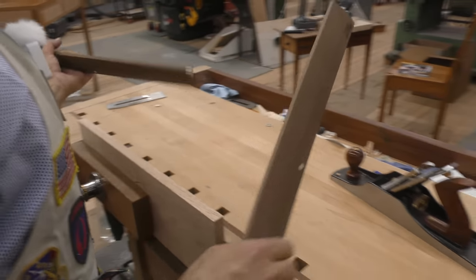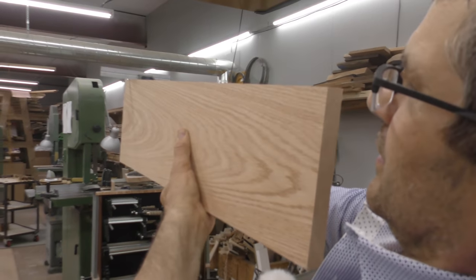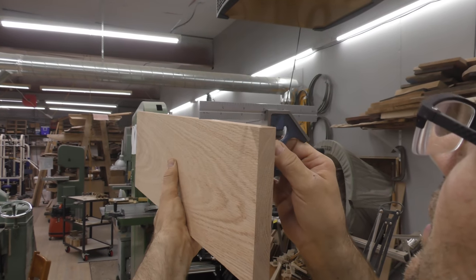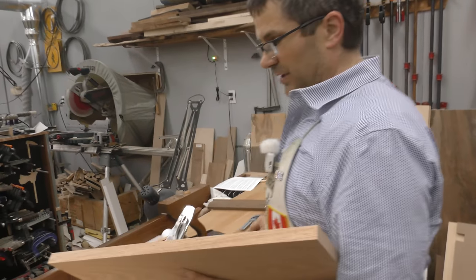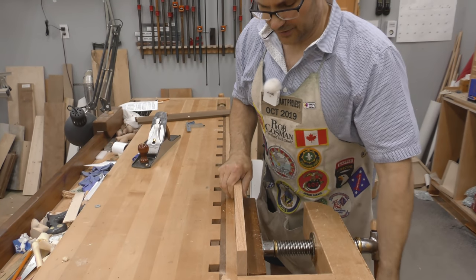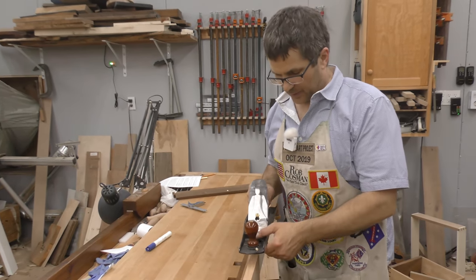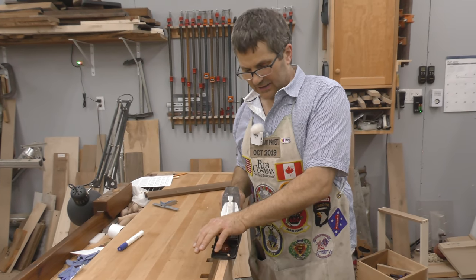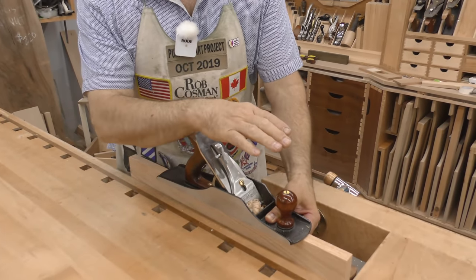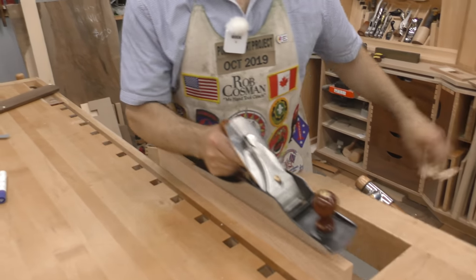You may not have winding sticks to check it. So let's pull it out of the vise and see what we can identify. If I go to the back, it's high on the outside edge. In the middle, it's right on. But out here at the front, it's high on the inside edge. You can't work with that — if you tried to glue that up, you'd never pull the joint tight. Here's how I do it. First of all, understand what has happened. We tend to have the front of the plane guide the cut. So as you're bearing down on the front of the plane, the blade's following along, and as the board starts to drift, the front of the plane follows it and of course the blade follows the front of the plane — you just continue to make the problem even worse.